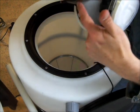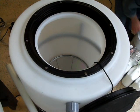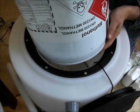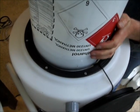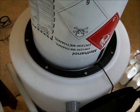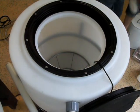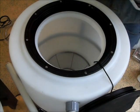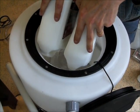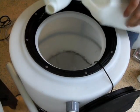Now we've got our mask and safety glasses on — we don't need gloves for this part. We're going to pour the methanol into the processing vessel. The best way is to let it drain down slowly so you won't get vapors everywhere. We'll wait until that's empty. Now we've got the 16-liter container empty, and we're going to add five of these 3.78-liter jugs — we need about 40 liters total.